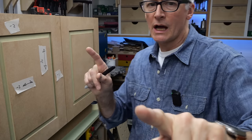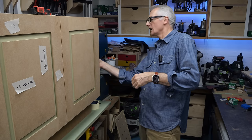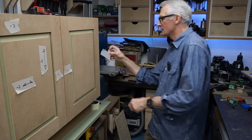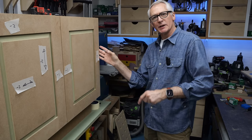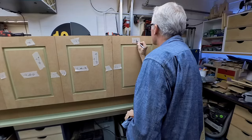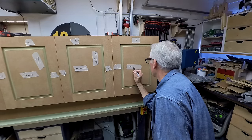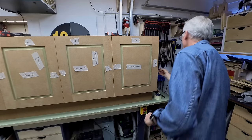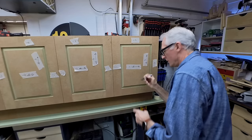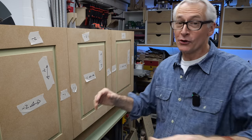The last single at the end of the run: it's one millimetre off the leading edge because it's up against another cabinet, but nothing off the hinge side because it's freestanding and can be flush with the cabinet carcass. Of course, we've got minus two off the height, so in terms of width it's minus one and in terms of height it's minus two. You can see how potentially complicated this can be, and that's just on a run of four doors.